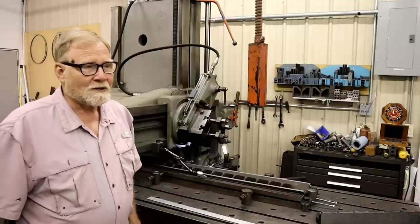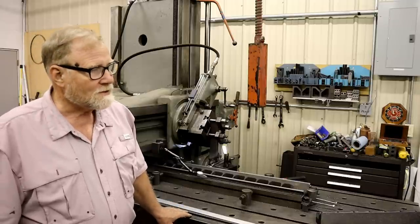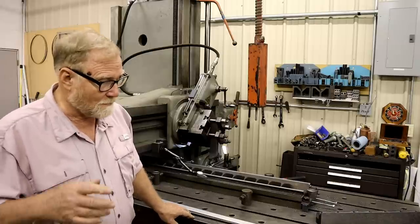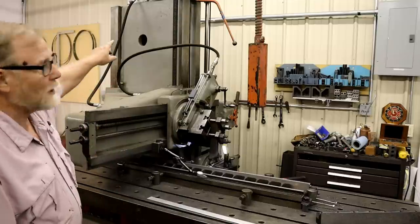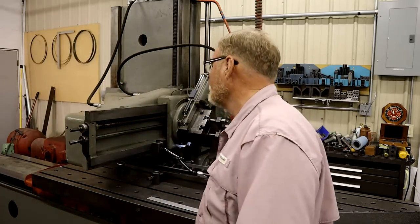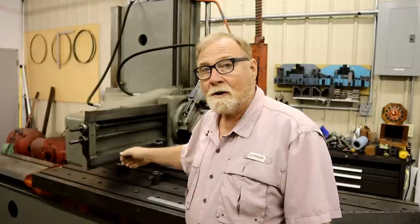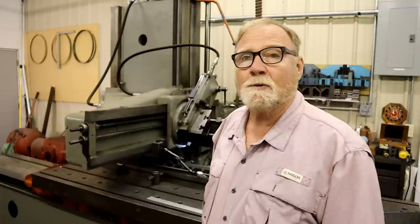But what folks don't understand is this isn't a Bridgeport mill or a lathe. This is a 28,000 pound machine. It's bolted to the concrete, leveled perfectly all the way through. This column up here weighed 8,000 pounds without any of the tooling on it. It's made for this 600 pound head to slide all the way over here and take the forces of cutting. It can cut a half inch deep if it wants, maybe 3/4 of an inch. I haven't ever pushed it that hard.